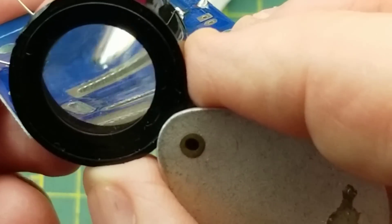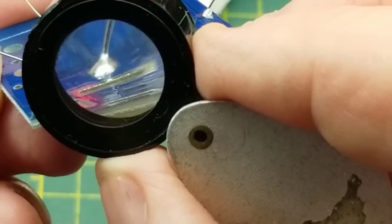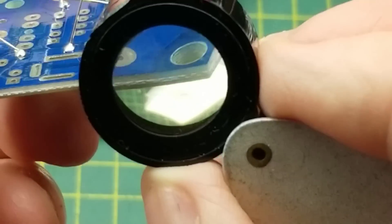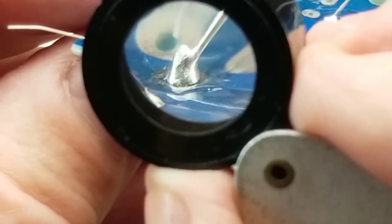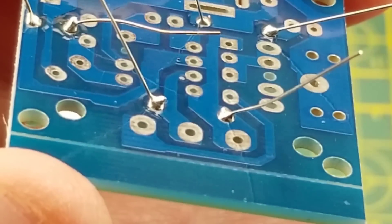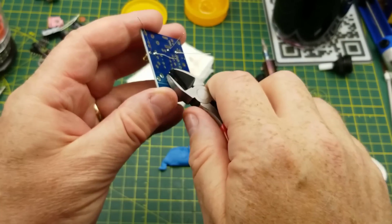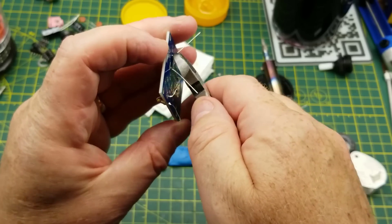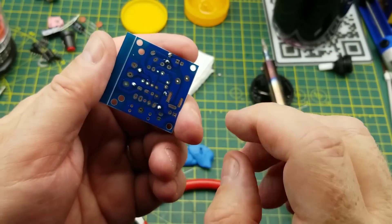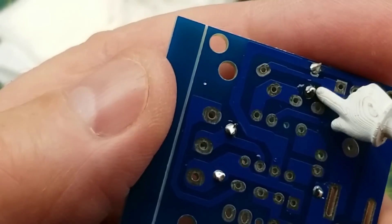Your goal is a nice tented-up shape — not blobby. A nice smooth little volcano where the solder creeps ever so slightly up the lead — that's what you're looking for. That one has too much solder on it, but they're not spilling over onto other pads and they're all making good contact with both the pad and the component lead, so that's good enough. Now you just trim the leads off close to the board. These aren't flush cutters so they'll leave a little wire standing free. Be careful not to crack the joint.